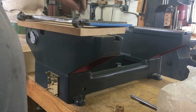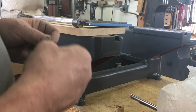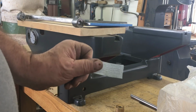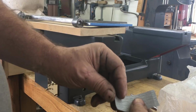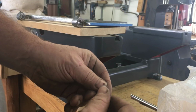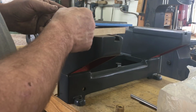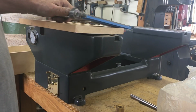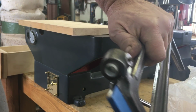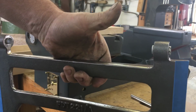Quick little tip on when you're painting cast iron and it has bore holes that you don't want the paint to go in. The easiest way to deal with those and masking them off is I use my old sandpaper. All you're going to do is roll it towards the grit, because you've always got some old sandpaper. Then you can just stick that in the borehole and it'll uncoil itself and protect your boreholes. Now you can spray it. You can even run a wire through this and hang it for spraying.